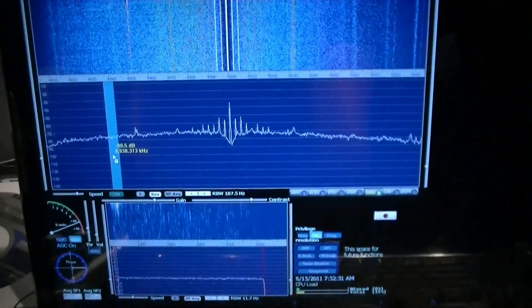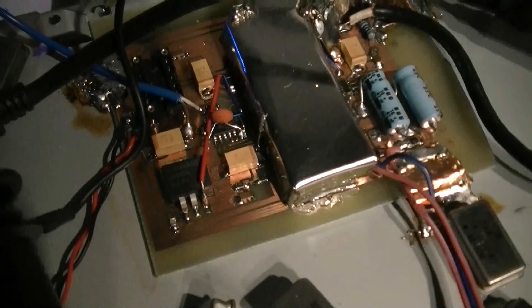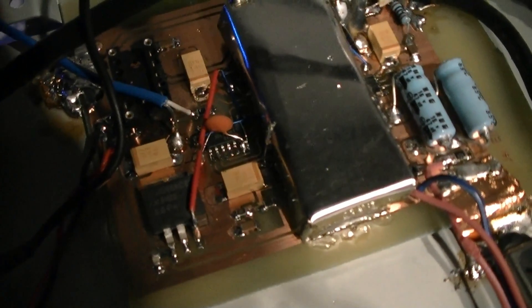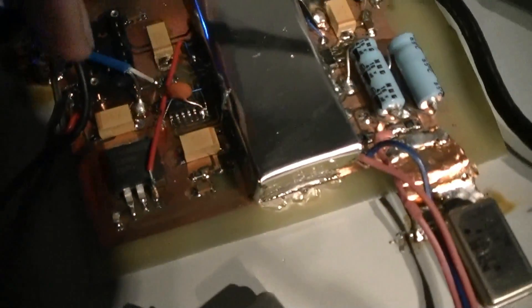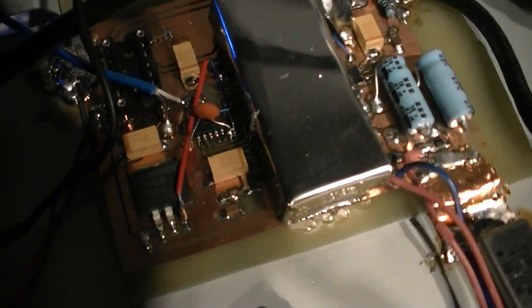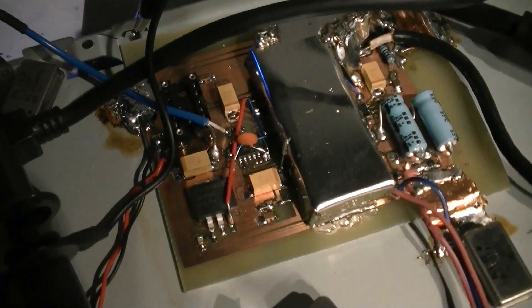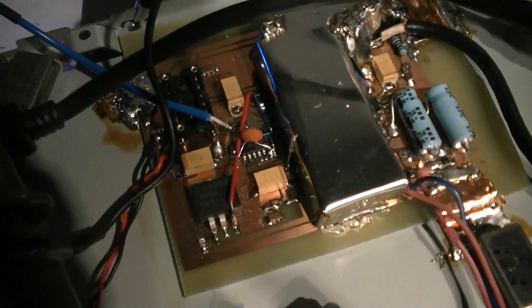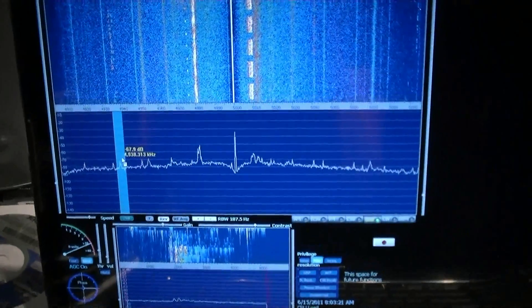Without all these modern tools, some of this stuff can be kind of tricky to debug. Here is the fix for the ringing that was going on in my circuit. Because I was building this on a one-layer board and I put a ferrite between the power of the 74HC74, I accidentally set up a tank circuit. So I added a little odd-value capacitor in there and squelched that. We're back to a much cleaner signal now.